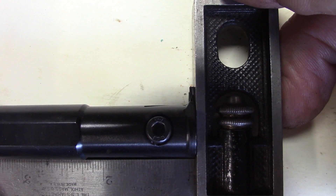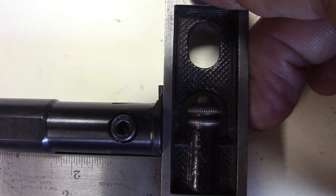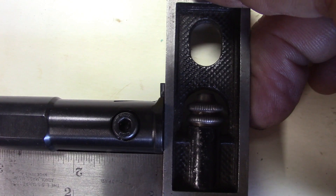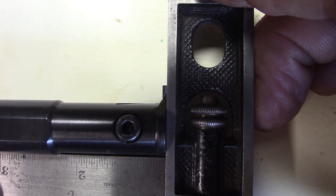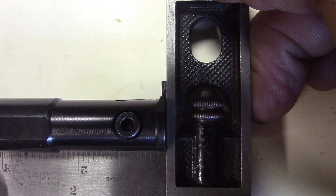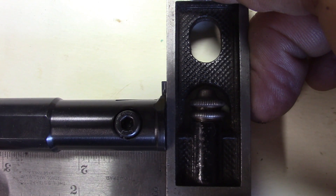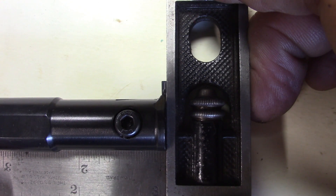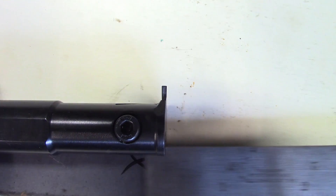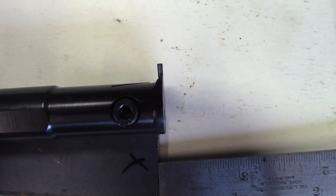Installing a small square on the end, let's see how perpendicular the insert is installed relative to the tool axis. We're in the middle — it seems reasonably well lined up. For the distance it has to work, I'd say it should be reasonably okay. If you pay five or ten times the price, you might get slightly better alignment, but for just about any use you'll do with this, you should be pretty happy. Insert is well installed and seems solid — let's go test the bar.